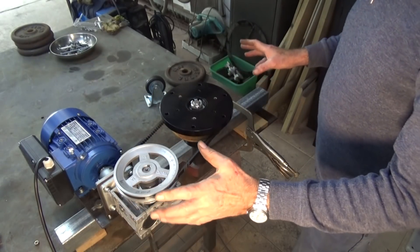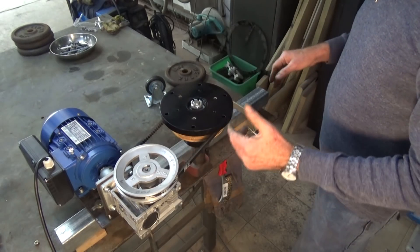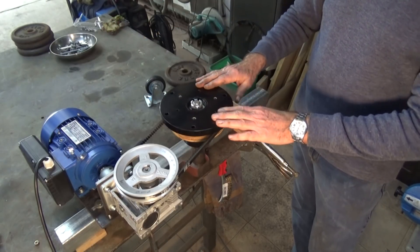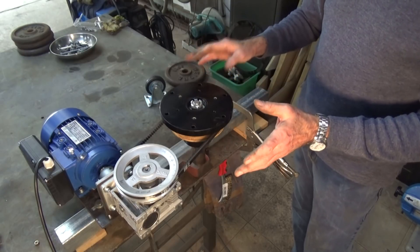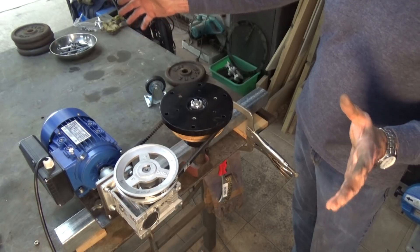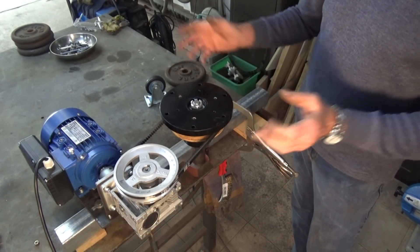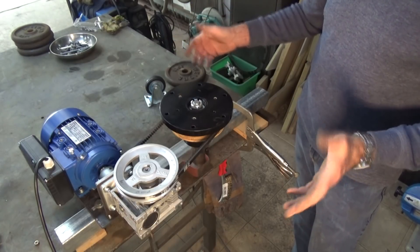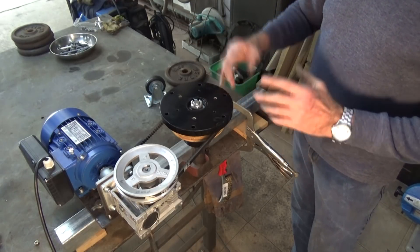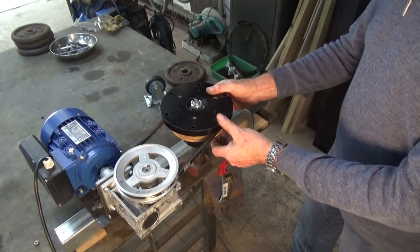I'm going to leave the video here now because you've seen the drive unit module and how that applies to our sand muller build. In the next video, we're going to look at making the mixing drum that sits on top of this plate here. That's the thing that held me back from doing this build for a long time — I was trying to figure out a way of getting a large disc, 725 millimetres in diameter, that was strong enough and durable enough to grind sand in. Ideally you would use something like stainless steel, aluminium, or cast iron would be even better. But I just didn't have anything big enough in diameter and thick enough, and I resented having to go out and buy stainless steel because it gets very costly.